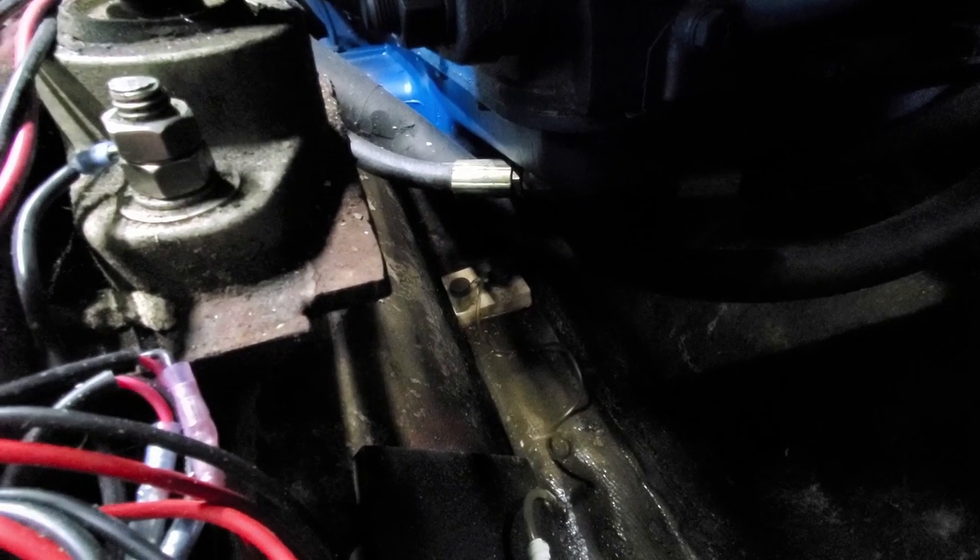There's the pump, and back there is the pickup. That pickup is just a plastic box I got at Home Depot. I cut some notches in the edges, put a big sponge in it, and glued two lead weights on it to keep it seated. There's a fitting at the top, and the big thing is to keep that fitting airtight so it sucks water and not air.